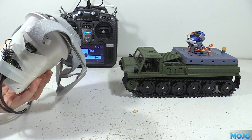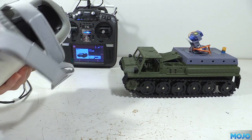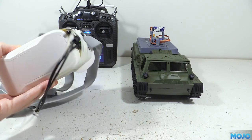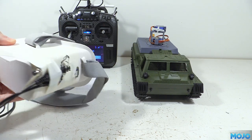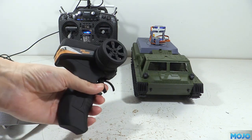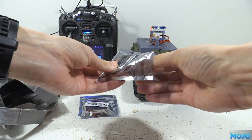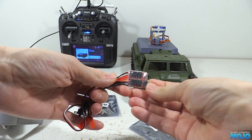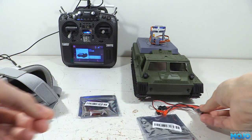With how far the FPV equipment has come, and of course the head tracker project, these days the most difficult bit is the gimbal. Unless you throw quite a bit of cash at a brushless gimbal, most are just very basic and not really that useful. Of course, if you don't have a 3D printer it can be a bit more difficult, but there are businesses that will print things out for you. Right now the E1 itself is of course still stock, so to drive it we need to use the WPL radio. The idea is to hook up a couple of small ESCs and use the Jumper TX to drive the truck as well as handle the gimbal. Ultimately I'd like to put together a custom board that does some sound and what not, but the two ESCs will be a good interim solution.